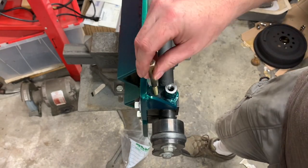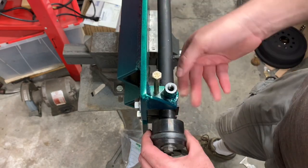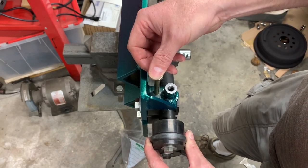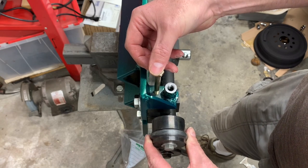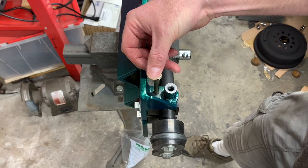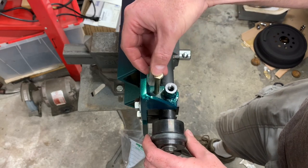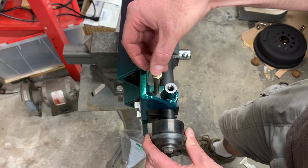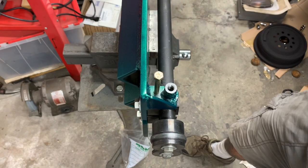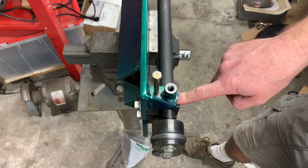Alright, so we've got our hole and our bolt fits through. I'm going to leave it at 5/16ths for now. When the shaft travels up, it does move in a slight arc. The only thing that's going to hold the bolt straight is spring pressure, so it remains to be seen how much I need to open up this bottom hole — it might need to go slightly oversized to allow for the slight arc. Now I need to pull the top shaft, take it apart, pull the bearing block off of it, and drill and tap my hole where my mark is.